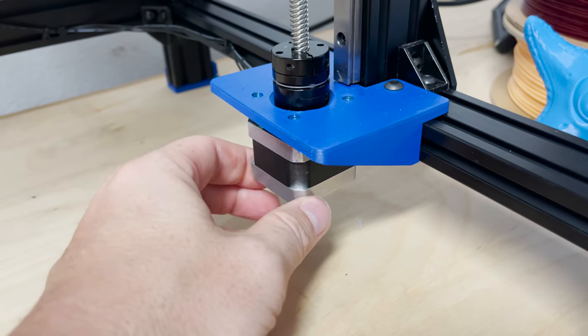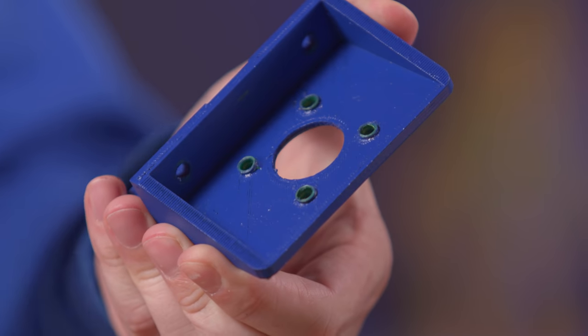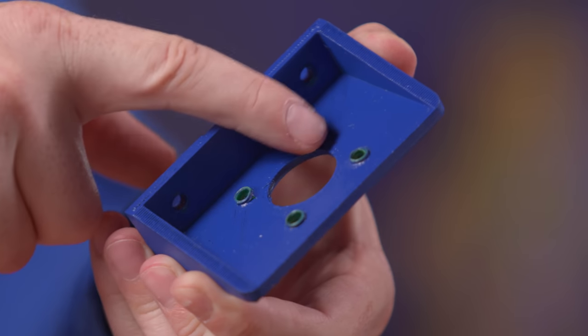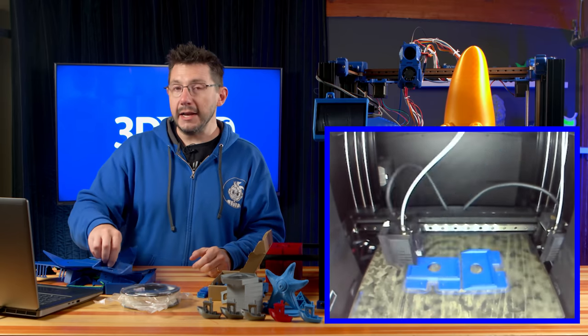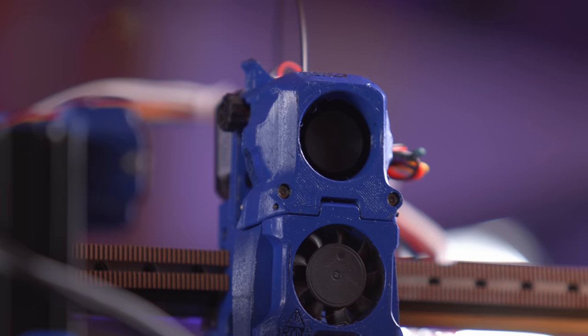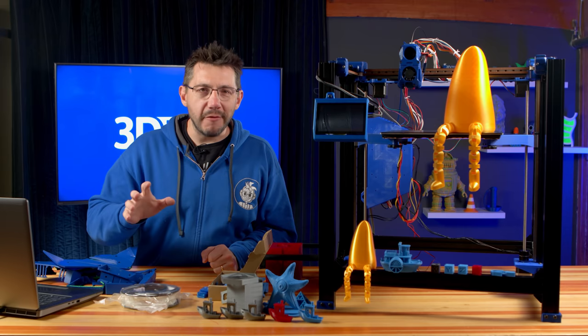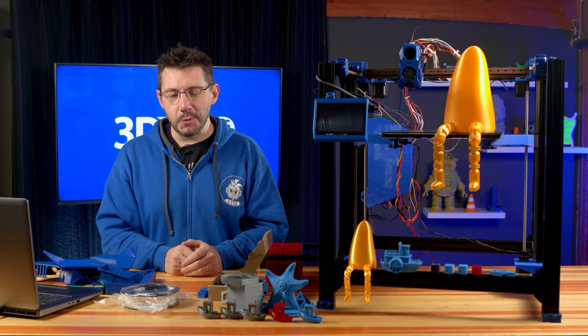Max is 14 — he's learning about this stuff, and reprinting in my case was totally fine. Other problems I ran into: the Z brackets held up, but at one point in printing the motors fell through because the screws pulled through the plastic. So the brackets you see on the machine are actually printed on the Raise3D E2 in IC3D ABS. The motion components and the head have held up, but they do suffer from similar print quality issues. I don't want to reprint everything on this machine — we have to evaluate what Max sent — so I've limited my reprints to just what I described.